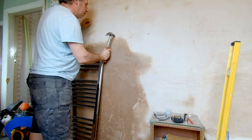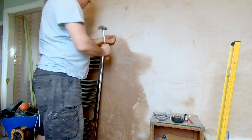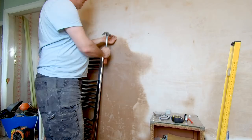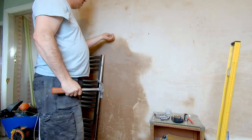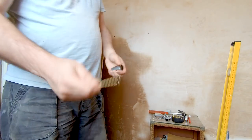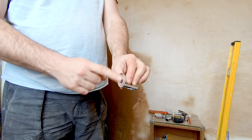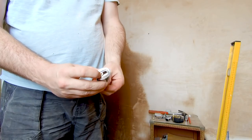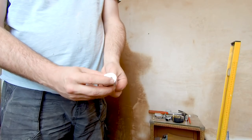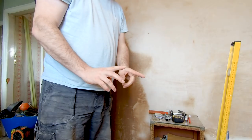That should tap in okay - just a little tap with the hammer. See if a screw will help. I like to push these a little bit further in past the edge of the plaster. Because I've got no screws with these, I don't want to use screws with an angled end - these are only made out of cheap plastic and you're probably going to find that's just going to start to rip through the end. So I need to go and find some screws with flat ends.